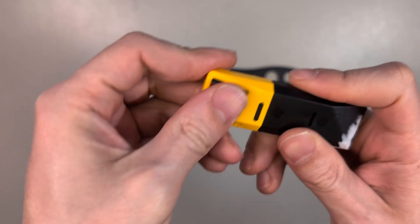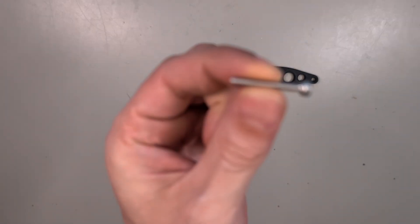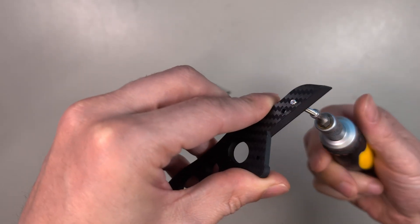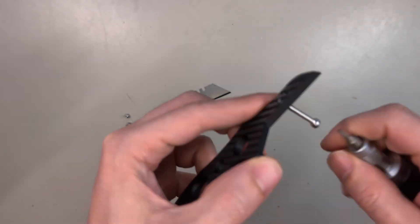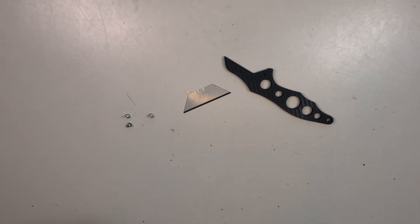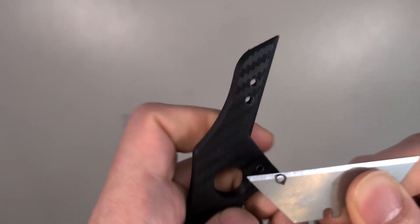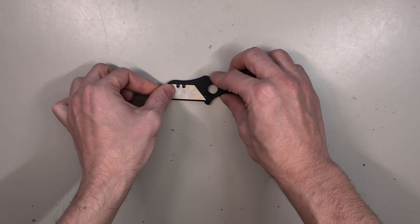To install the blade, you will need three of these M3x4mm screws. Before I insert them, I will use this longer M3 screw to pre-cut the threads. I just turn in the screw by hand until it comes out on the other side, and then I repeat this for the other two holes on the knife. After I finish this, you can see that there is a bit of material sticking out the end of each hole. To get rid of that, we can use the blade that we will later install on the knife. These blades are really sharp and so it's very easy to remove the burr around the holes.